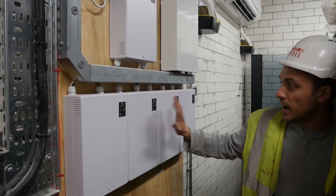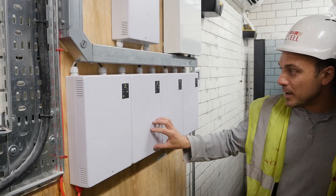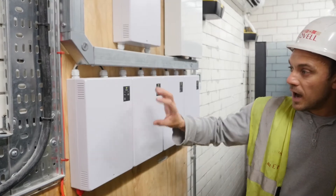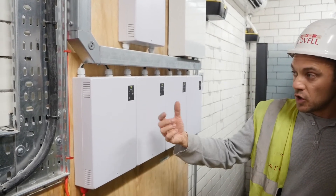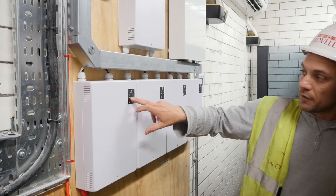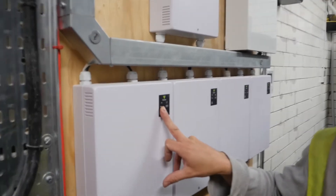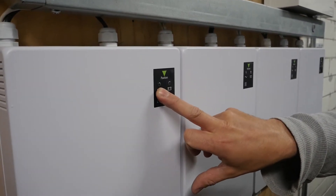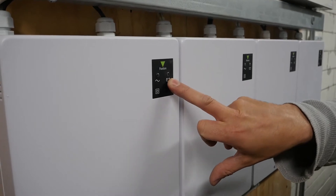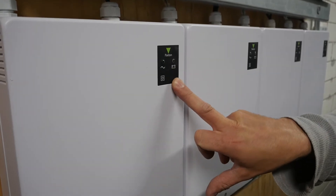They've got a healthy power supply. If for whatever reason there's a power cut, they have a backup battery and that will continue to run the system if there's no power. There are indicators on the front here that tell you the power is healthy — the green light being on means you've got power. If that light's extinguished, it'll be running off the battery, and if the red light is lit, there's a fault on the battery unit.